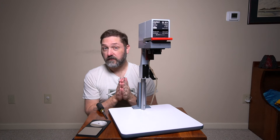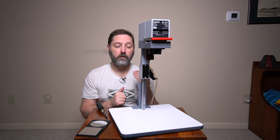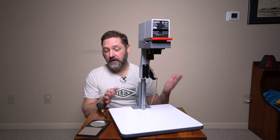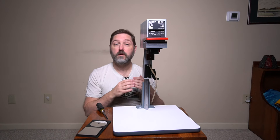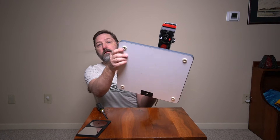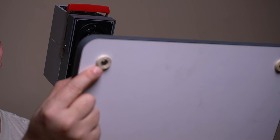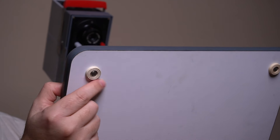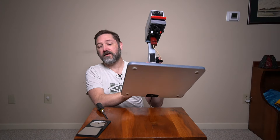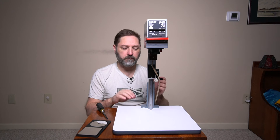The adjustments on this are not factory made. There are some points where we can adjust, but for the most part we're going to be shimming different things. If you need to level the base on the table, underneath there are small feet that are screwed on. You can loosen them with a screwdriver and then shim with either a washer or some kind of brass shim stock that you can cut with scissors and put in there.